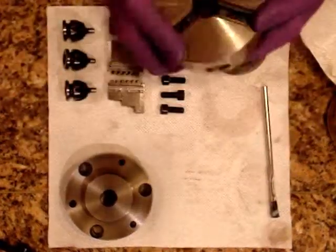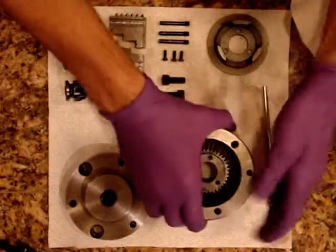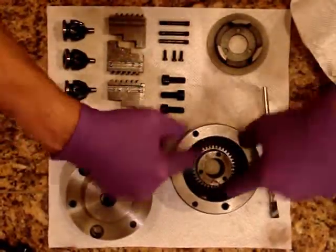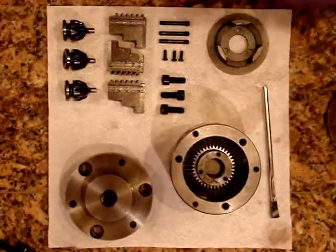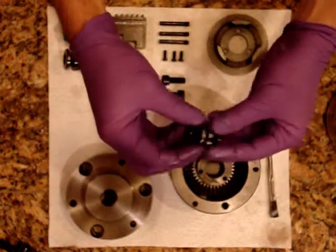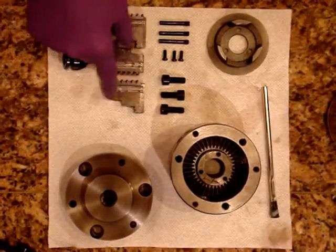Let me see if I get this down in here — just got to kind of seat this. Okay, so that's down. You can see that turns freely now. And then, if I remember correctly, the next part was these little pinion gears, which accomplish turning the scroll. And, of course, the scroll is what draws in or moves out the jaws on the chuck.